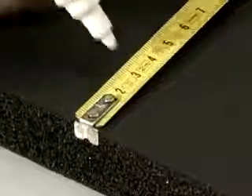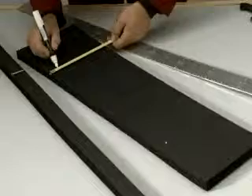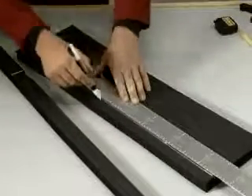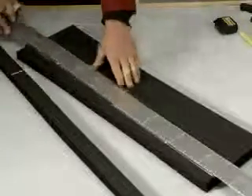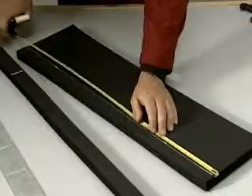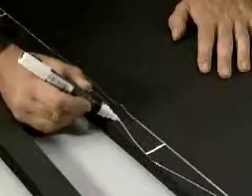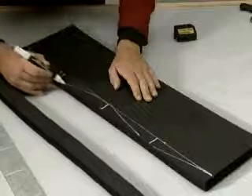Make the T-branch. Measure the distance to the insulating material using a strip of K-flex sheet. Mark the distance on the piece previously prepared. Trace the line and divide the length into four parts. Connect the points by creating peaks and valleys.